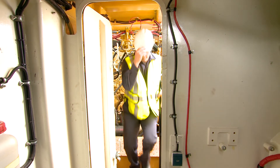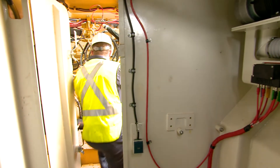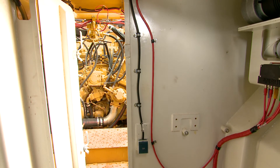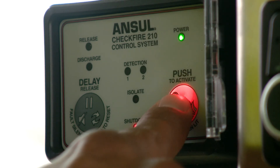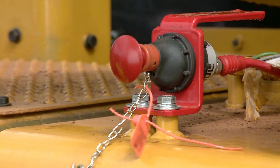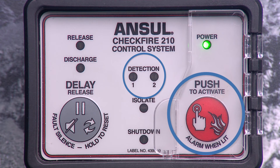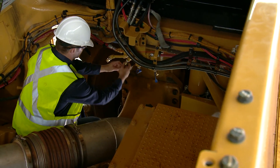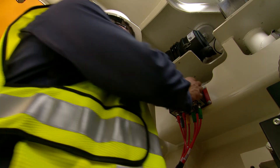The CheckFire 210 provides an isolate feature that is intended for use by vehicle maintenance and service personnel to minimize the occurrence of accidental activation during routine vehicle maintenance. When placed in isolate mode by activating the switch, the isolate LED and audible will pulse two times every 30 seconds. This disables the system from initiating an automatic release. The system may still be manually actuated by either the red Push to Activate button, or by pulling the ring pin and striking the red button on a remote actuator, causing an immediate release. If a detection input occurs while the system is isolated, the detection circuit and red Push to Activate button will pulse once every second; however, the system will not automatically release. Investigate the release input and take appropriate action. Return the system to automatic mode by switching the isolate switch to the normal position.